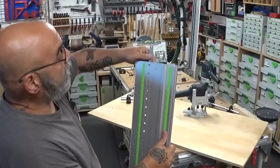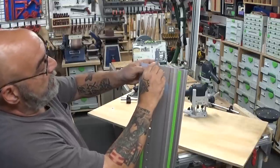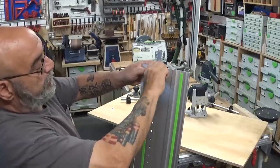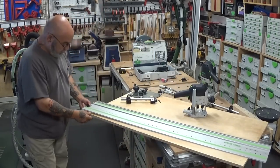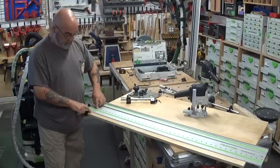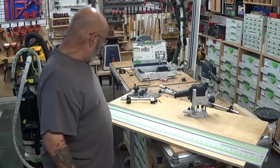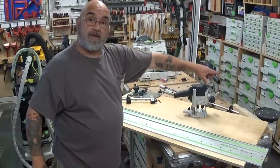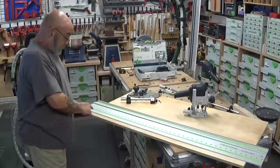can we see it? Yes, you can. You want it so that you can see the 16 and it's down and up facing you. You tighten the screw, this thumb knob. When you place it onto the board, it stops at a specific position to give you the first index at the bottom. And then each one corresponds up the board. When you flip this down to the other side, flip this whole thing around, now you'll have the same on this side with the same position that this first pin peg is at.